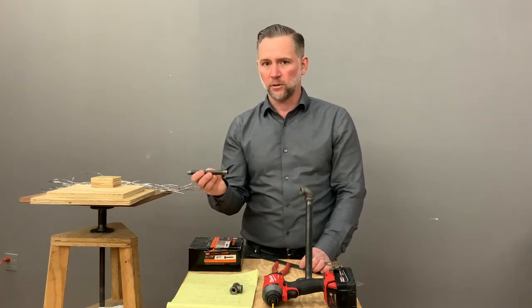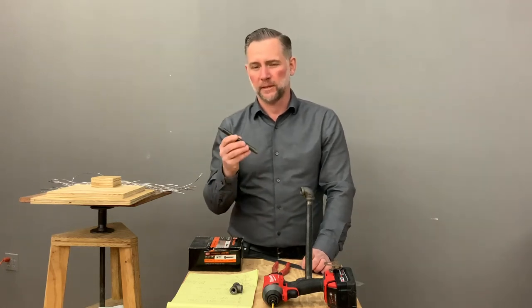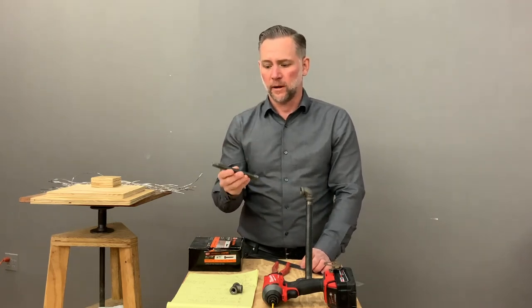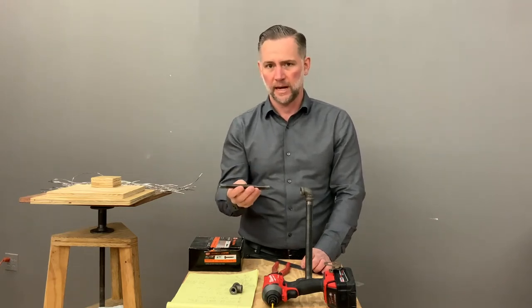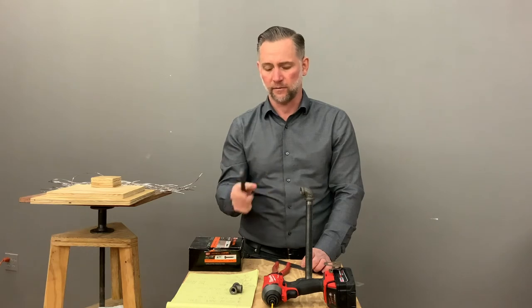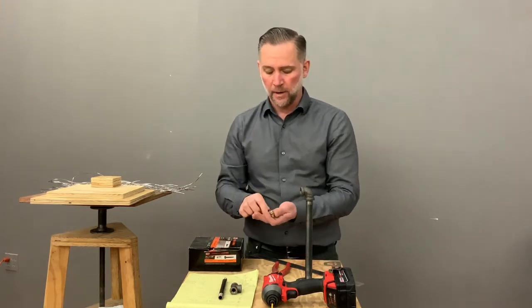If you can't find a part you're looking for, you can use the galvanized pipe. But what I would say about it is the galvanized pipe is going to be much more expensive. Considering you're not going to be leaving this outside, it's not going to get rusty. You don't need the galvanized. The galvanization protects from rust. Just simple black pipe is going to be the cheaper of the two.